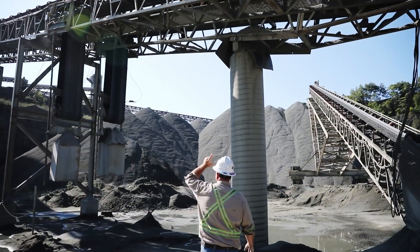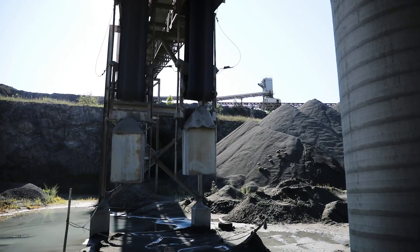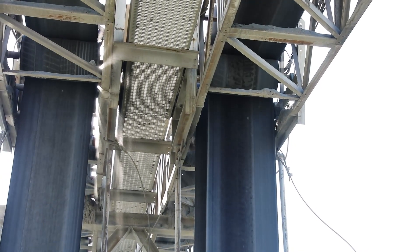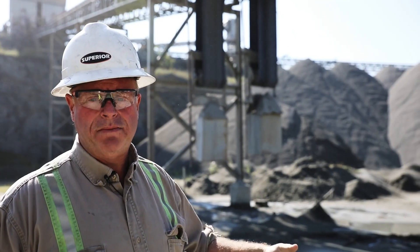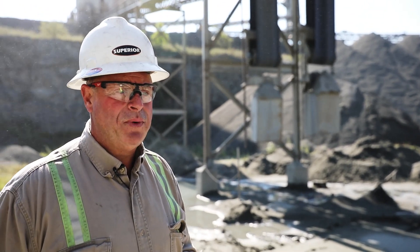As we come back down the belt line from the head traveling towards the tail, one of the things to look at is the counterweight and bend pulleys — that's a dead giveaway on any amount of carryback. We can see on this one we've actually added probably another 1,500 pounds to their counterweight because there's a big pile of carryback on there. The material is heavy — if you were to fill a standard pickup truck bed level with carryback, it'll weigh close to two tons.